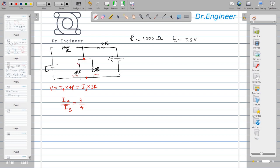So here this is 3i and here this is 4i, so the total current flowing here is 7i. I am assuming the current coming from this battery is i1 plus 7i. So here 7i separates out. According to Kirchhoff's first law, the remaining current has to flow on this side. It's very simple. Now you have only two unknowns, so you need to apply only two Kirchhoff's laws. So I am naming the circuit A, B, C, D. I'm not using E, I'm using F, G and H, right?